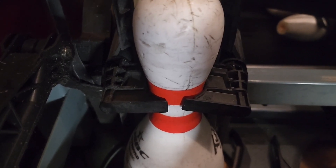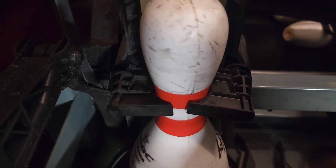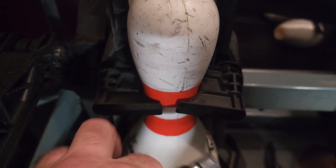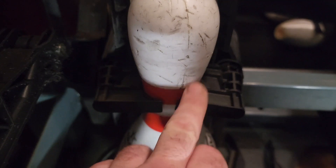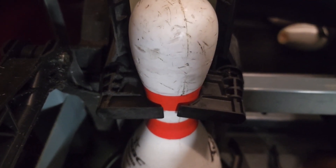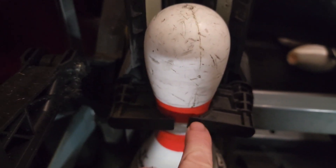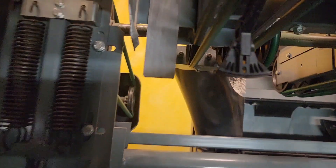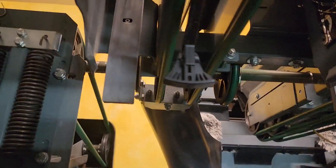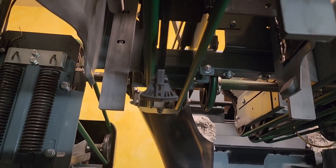It's kind of an interesting one you don't see happen very often. The grippers aren't timed evenly with each other — this one's out of time, this one's good, perfectly flat, but this one's sticking up a little bit. We were having some issues with pins multiple loading in these pin holders, definitely due to this gripper not sitting where it's supposed to be. With that gripper sitting open, it might inadvertently contact that pin release lever and drop a pin when it's not supposed to.